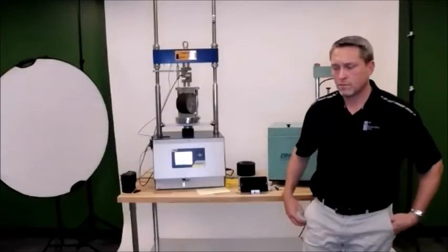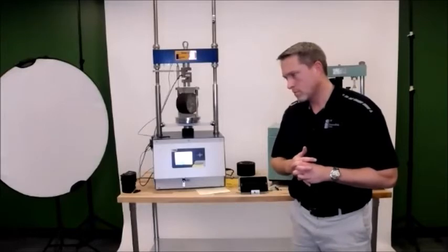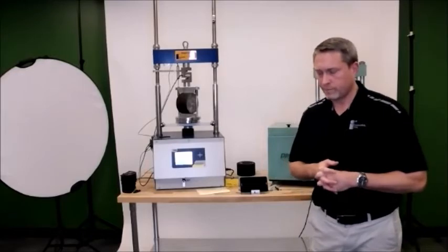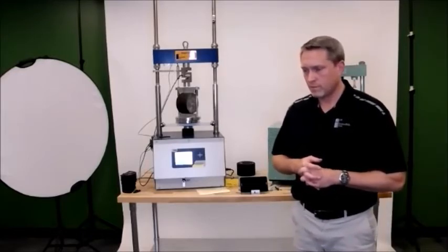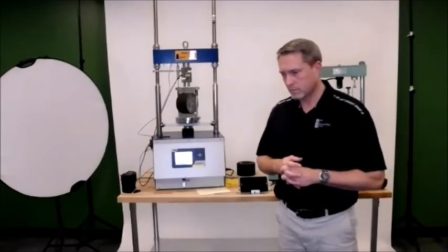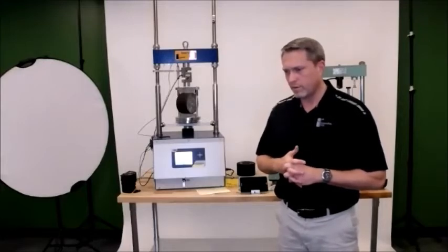Yes. Well, that would probably be controlled by getting what you need to get your air voids. So are we using a calculation like we do with Lottmans then, to target a height? Yes, Alex, that's correct. From what we know from the researchers, you're compacting them just like you would compact a Lottman sample, averaging out air voids to try and get your target.